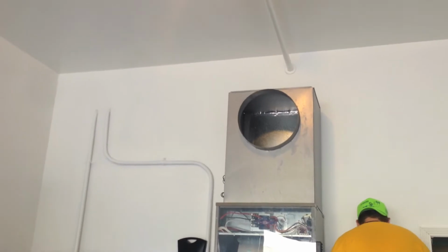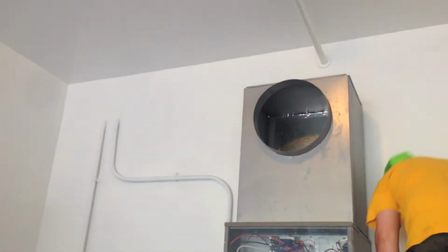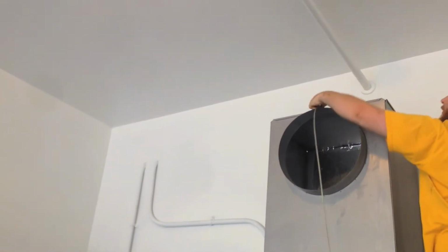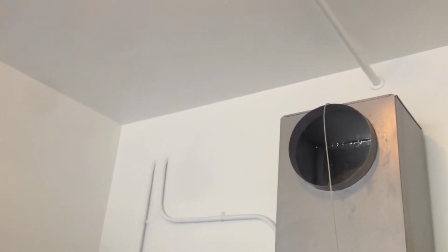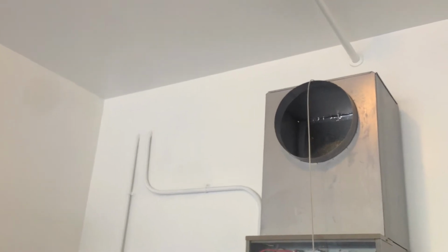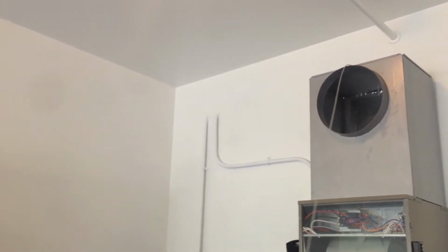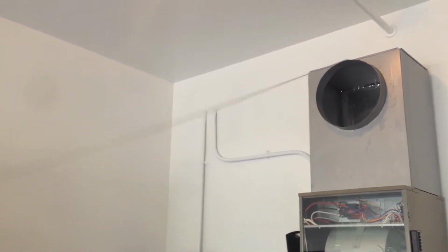To install the fabric duct, the first thing you want to do is run a cable from one length of the room to the other. Try to hit a stud in the wall or the ceiling, as we want to make sure that the eye bolt is very secure so that the cable can be tightened as tight as possible. Once the eye bolt is screwed into the wall, hook the tensioner to the eye bolt, then the cable onto the tensioner.